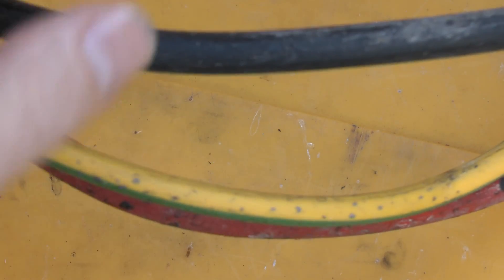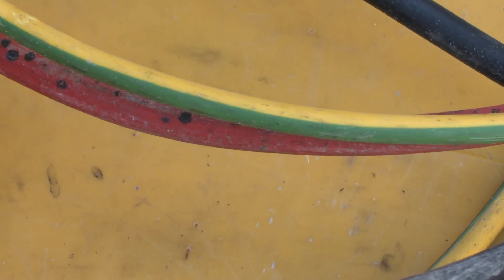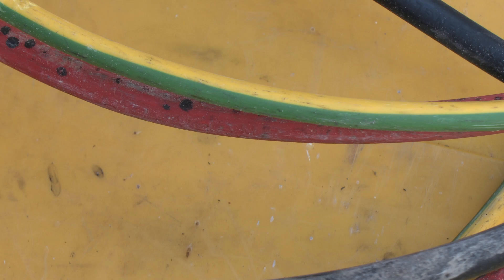So it's affecting all three conductors — it just happens to be more visible on the red one. The cables aren't desperately badly damaged but there is certainly evidence of the polystyrene starting to react with the outer PVC covering. The cables have been installed since the building was constructed about 40 odd years ago. The wall insulation was added far more recently, probably only two or three years ago, so it hasn't had a huge amount of time to do its damage.